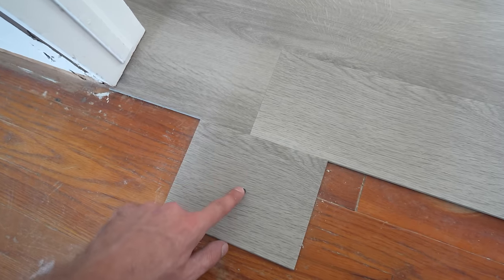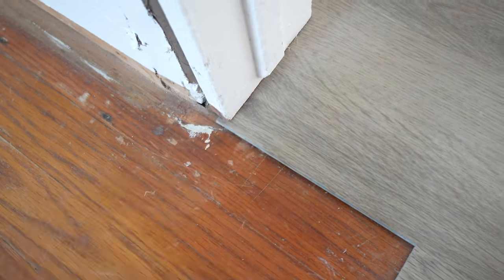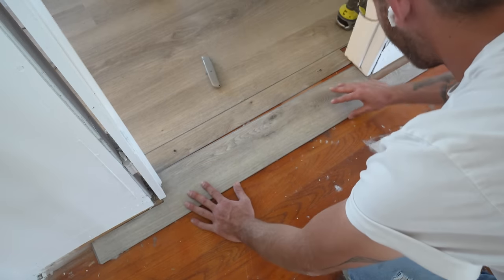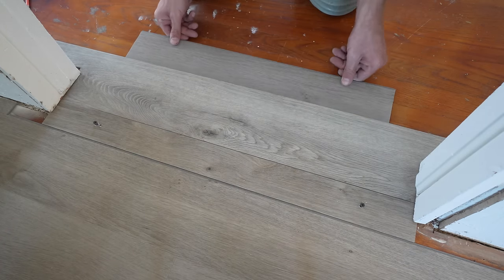I've secured my floors in place while I'm working in other rooms. I set up this example to show what it would be like if your seam was right in the middle of your doorway — you'll find that it's really hard to get underneath the other plank. I'll use a scrap board and work it underneath to assist.